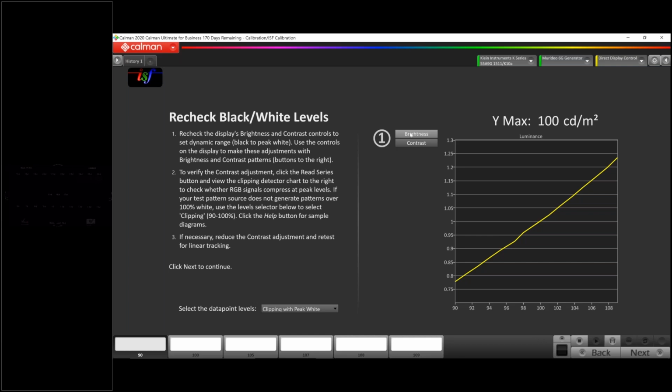Now I'm looking at the black level again. We checked this way earlier, but we're checking it again because we're getting towards the end of the calibration here, and I can now see the bottom row of boxes, which means my black level is too high. We had it set at 54 and everything looked normal, but since then things have changed. So let's take that black level down to 50. Oh wow, you know what? This actually is way better.